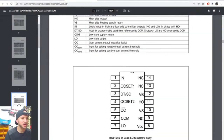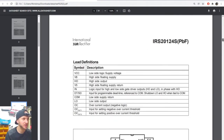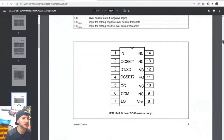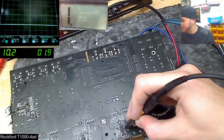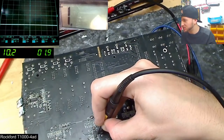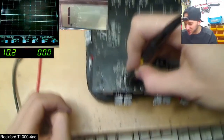The next thing to do was to start looking at any pins for this chip that could be telling it to shut down. Pin 3 was actually shutdown and dead time, and pin 5 was over current — both of these would be able to prevent the chip from working if the wrong voltage was on them. On the three other good channels, pin 3 would start at negative rail and then bump up by about 12 volts to tell the chip to activate. This wasn't happening on our bad channel — it was staying down at negative rail, essentially telling the chip to stay shut down.